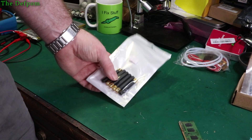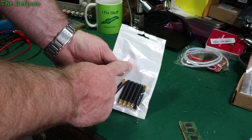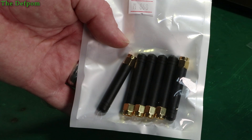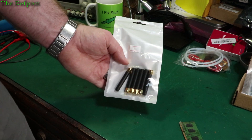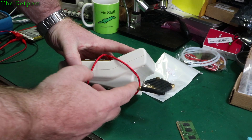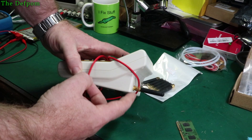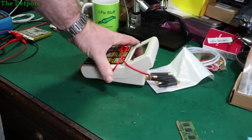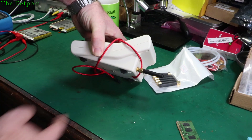I've got some more 868 MHz antennas. This little short stub one is 5cm — nice and compact. I've got a few already and they're working absolutely fine. On the item they go on, they stick out the back, but I really want them at a 45-degree angle. I've also purchased 45-degree SMA adapters which are on the way, so the antenna will come out the back at 45 degrees and be more vertical when it's on the desk. Horizontal polarisation isn't correct — vertical is much better.